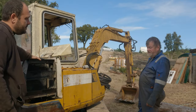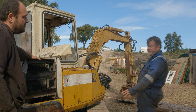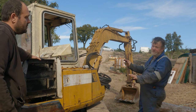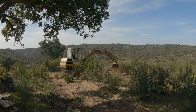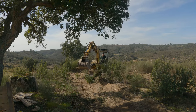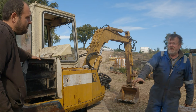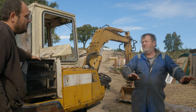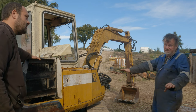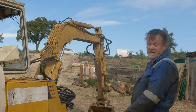Working the machine — obviously you'll gain experience the more you use it. The bucket should most of the time be as low as possible. You need to think about machine stability. On nice level ground digging a trench the machine will be stable, but on rougher ground with bushes — there can be holes, boulders, or tree stumps you can't see and might catch underneath. You basically shouldn't be driving anywhere you can't see what you're going into. On that kind of ground treat your bucket like a walking stick — walk along and dab and push with the bucket to feel out what's there.